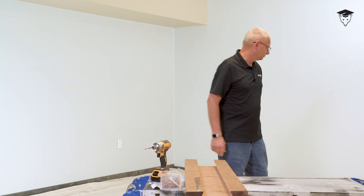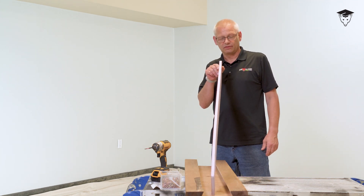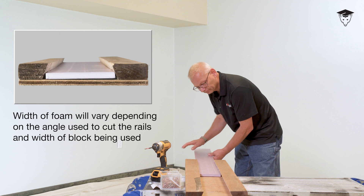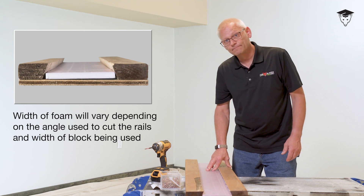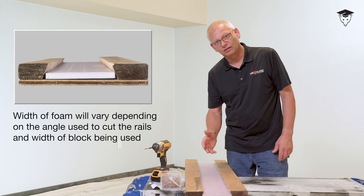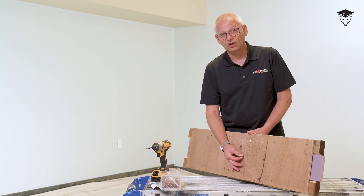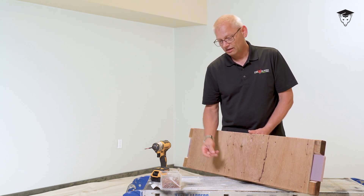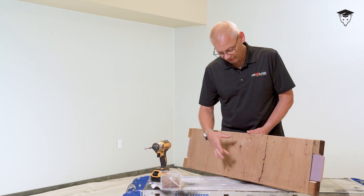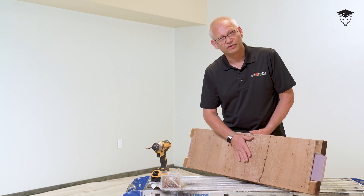I'm getting a little bit of insulation — not much — but more importantly, later on when I'm screwing I can put screws through here and not hit concrete. There's foam behind there giving me a full inch before I hit concrete. Ideally you'd have even more, but I have a full two inches of anchorage on either side. So knowing that makes it a lot easier to build with this.